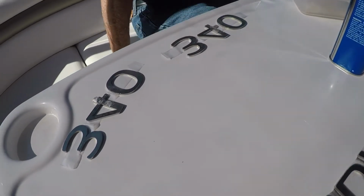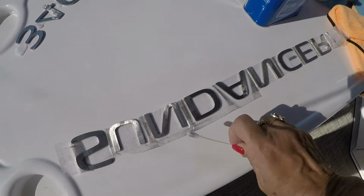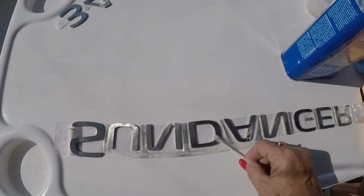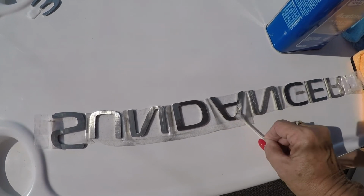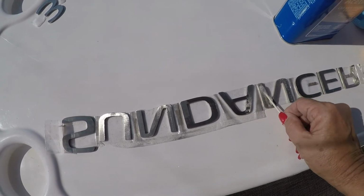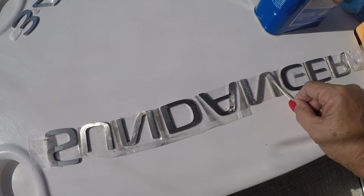So one of the first steps we're doing in order to get ready for putting these up is we're taking acetone and a Q-tip, and we're cleaning the back of the letters to clean off any factory oils or grease that might have been left on these letters when we received them and might impede adhesion when we put the 4200 on them.